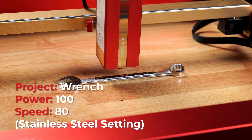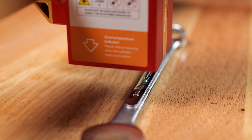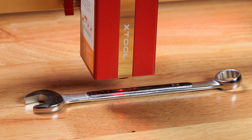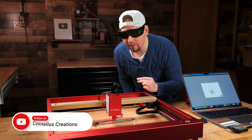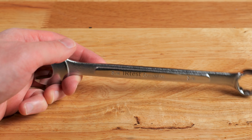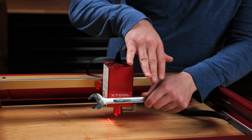I'm also performing this same test using the 20 watt blue diode laser for comparison. The test on the wrench turned out awesome — running your thumbnail across the lettering, you can feel a small catch, which means the etch is set. On the 20 watt version at 100% power: nothing. You can see where the 20 watt didn't even touch it. So from here on out, I will not be using the 20 watt for any more projects.